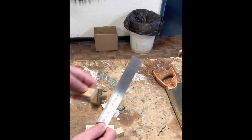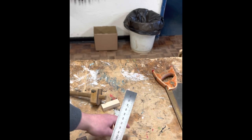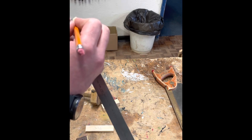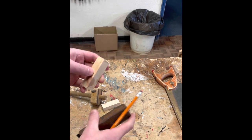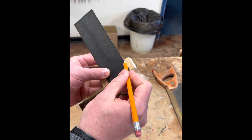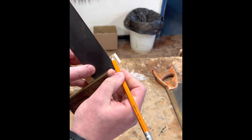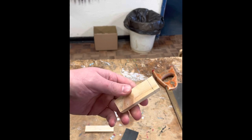Once you've completed that, we then need to start to mark out our lap joint. Measure the thickness of the thinner sides and then measure in from the end of the thicker side using that measurement. Make a little mark using the steel rule. You'll then get a tri square to tri square around three sides — along the wider face and down the two sides. That should then be the same thickness as one of your thinner sides, which you can then check.